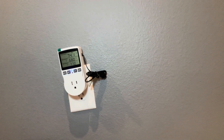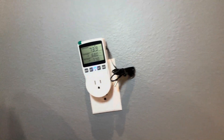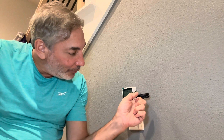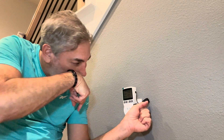My start temperature is set at 68 and the stop temperature at 77. So, using an aquarium as an example, it will turn the heater on if it gets too cold, and turn it off if it gets too hot. Watch — it just turned off because we hit over 77 degrees. It was on when the temp was low, then turned off when it hit 77.